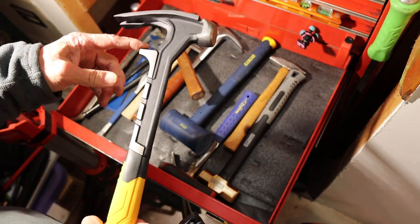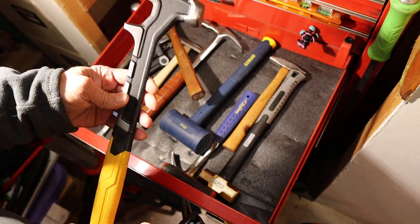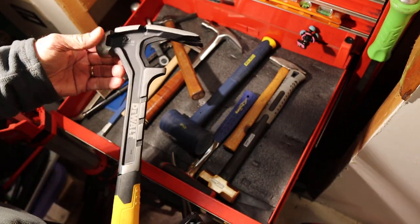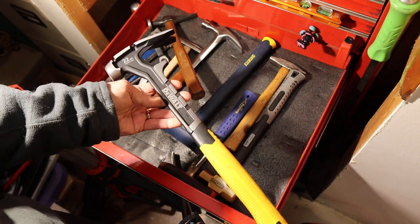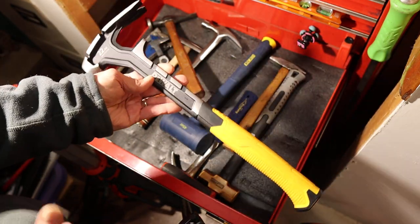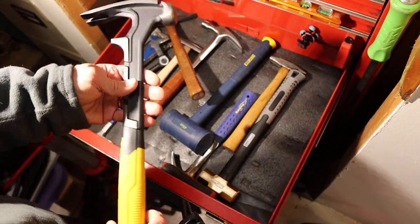So if you've got to go in and make some significant adjustments to a wooden structure, this is a good one because it both builds and it destroys. It does have the nail notch here, but it does not have the nail holding point because it's not really designed as a framing hammer. It's sort of an all-purpose, you know, go into a weird situation, not sure what you're going to end up with. And a lot of things have this kind of decon area. If I've got enough of a piece of wood, I don't see one handy. But this actually is a pretty good lever arm if you need to twist out 2x4s, kind of deframing instead of framing. But it's interesting to use.